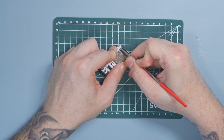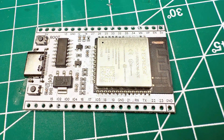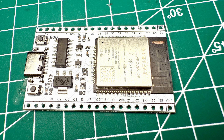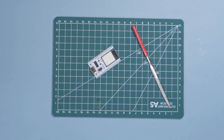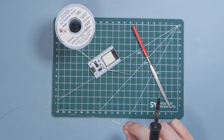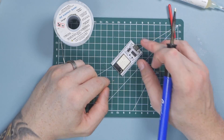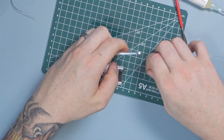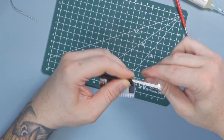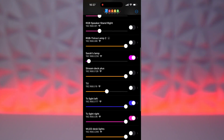The first step is to scratch away the etching on the PCB to expose the copper underneath. The internal antenna comes off and squiggles up - once I've scratched it off you can clearly see the internal trace. Then I take some 0.2mm enamel wire, burn the coating off with some flux and solder, and attach it to the ESP32. After cleaning it off with isopropyl alcohol, I wrap it around a screwdriver to give it a little antenna shape.